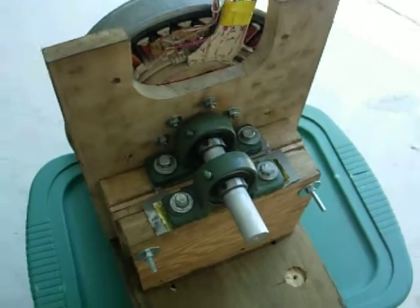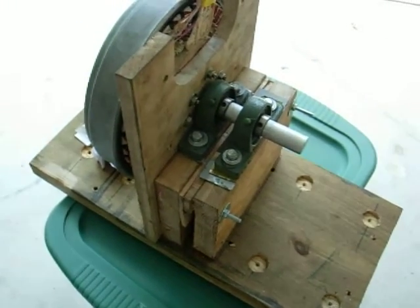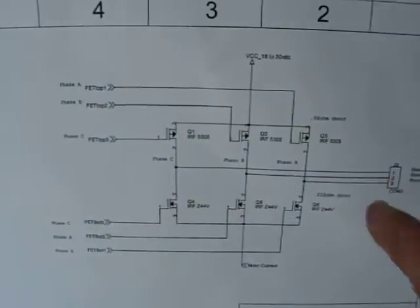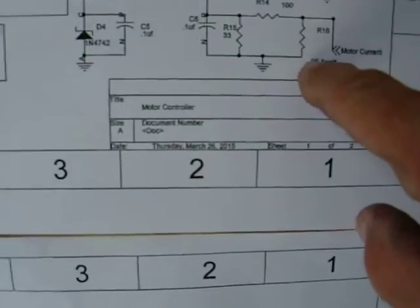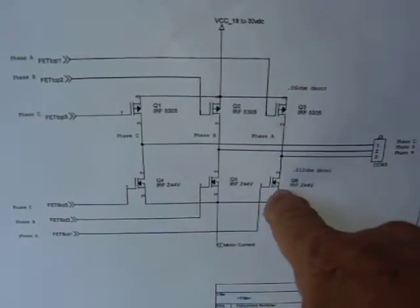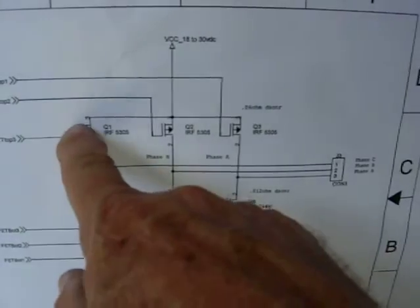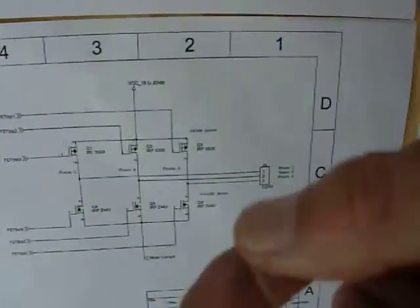I measured the resistance between A and B, B and C, and A and C, and found that it was 12 ohms. So you take the 12 ohms and go back to the schematic — look at these FETs and get the DC on-resistance. Then you go up to the current sensing section where you've got 0.05 ohms to add in there. These FETs have about 12 milliohms or 60 milliohms — I'm not certain. So when you have Q1 and Q6 on, for example, you add the 12 ohms plus the milliohm FET resistance plus the 0.05, and that's it.